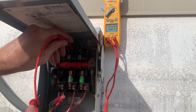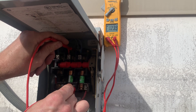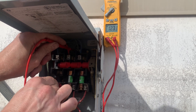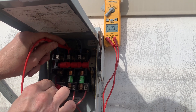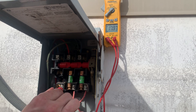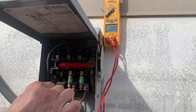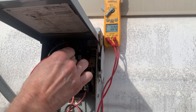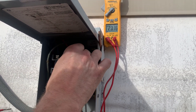If you take this to ground and touch ground to line three: 120 volts. Ground to two: 120 volts. Ground to one: 120 volts. I've maybe been calling it wrong all these years, but I learned this to be described as ghost voltage. There are 120 volts sitting on the line one load side of a circuit that is missing its fuse. Where is it coming from? It's coming from line two, across the fuse, into the windings of the motors or compressors, and then back.